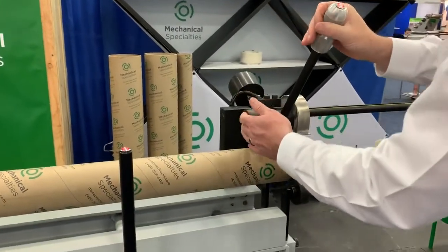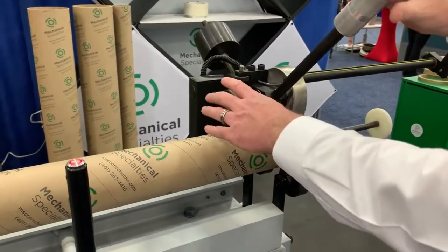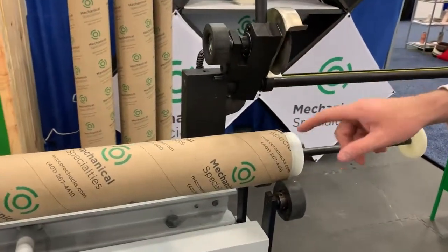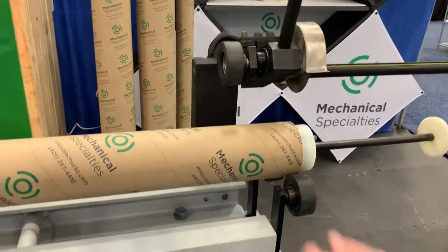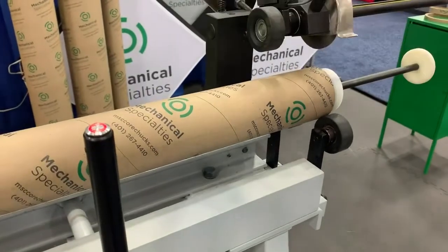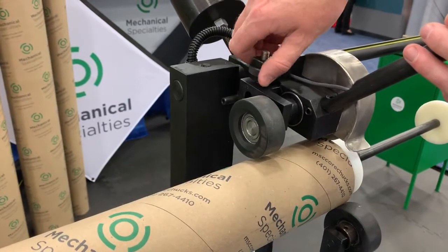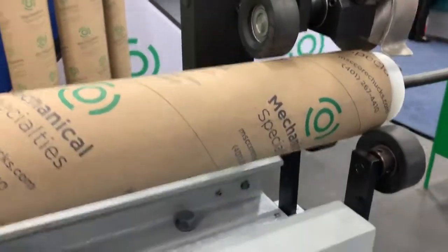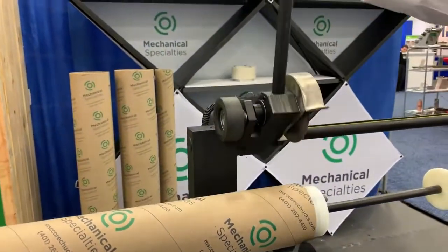In this assembly here we have a secondary roller acting as a stop so you cannot engage the blade too deep in the platen — this will thus create more life to the plastic platen. It is adjusted by this screw on the side. Simply by placing the blade just touching the platen, you can then turn the screw and this wheel will come down just until it touches the cardboard tube, and we know we'll just cut the cardboard tube and won't be cutting the plastic.